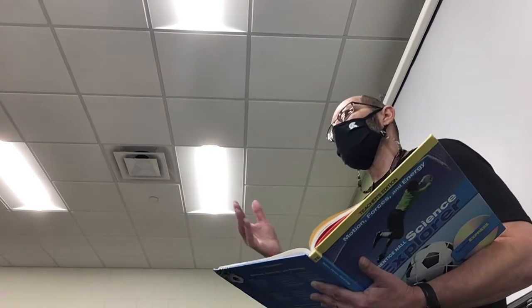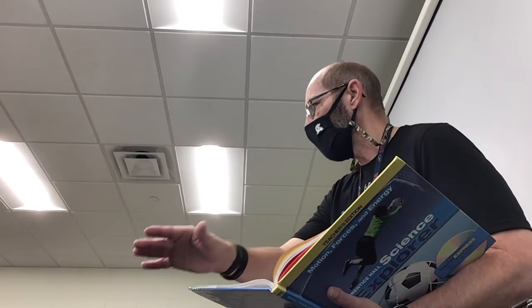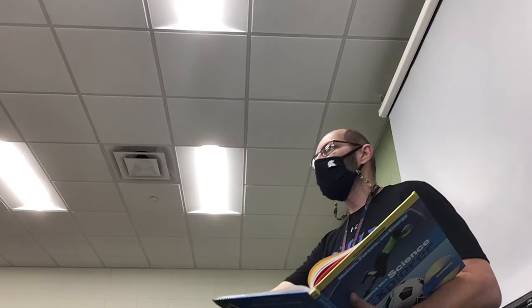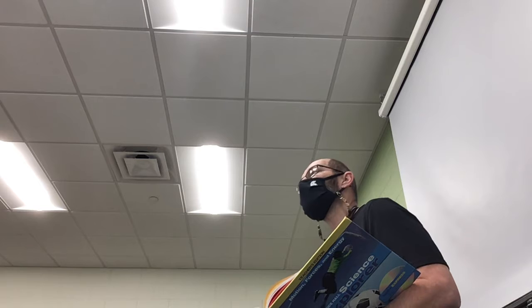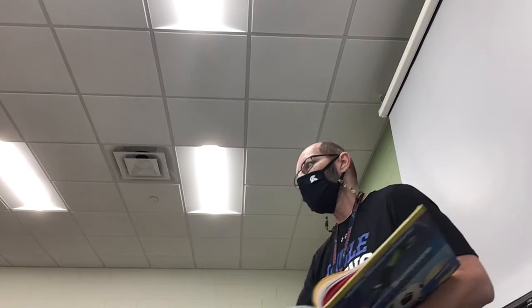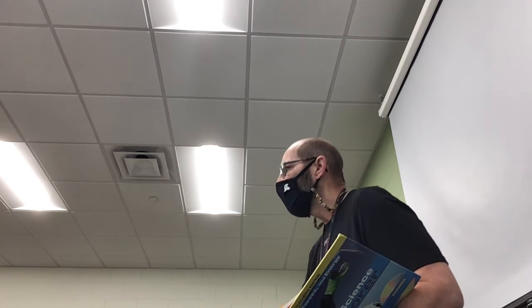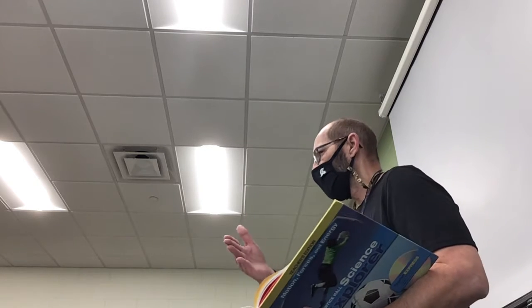So you can increase the mechanical advantage if you stretch that ramp out to 6 meters and you're still just going 1 meter high. Your mechanical advantage becomes a 6 at that point. It makes it even easier to move stuff up. You're covering a greater distance, but it's easier to cover, okay? Everybody kind of grab where I'm going here?